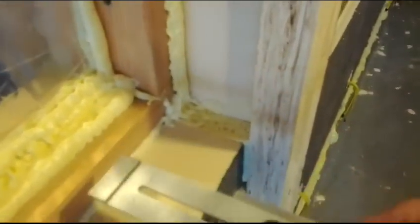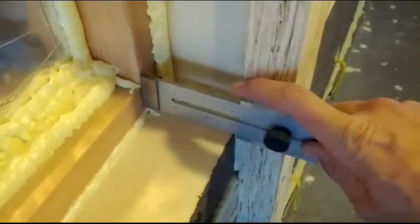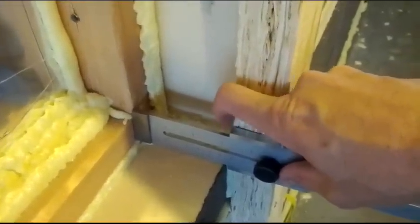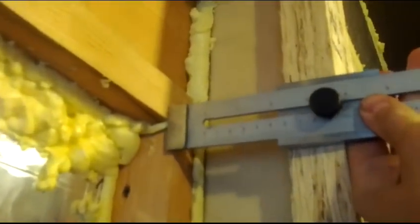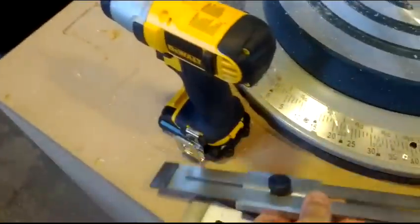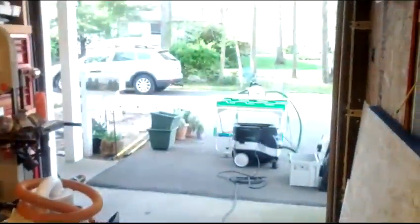You can never use relative dimensioning enough. I've got a stop rule — a slide rule — it's from Lee Valley. I put this against the inside and make sure that the inside edge of this sliding stop is even with the inside of the wood, which represents the inside of the sheathing. With that finished dimension set on the plywood, I catch this on the edge, make a pencil mark at the tip, and I've got the right dimension — guaranteed, no measuring. I do the same thing for the top using a different stop rule. Using the two of them, one trip in, I get both marks, go out to the plywood, reference them, cut them, and we're good to go.